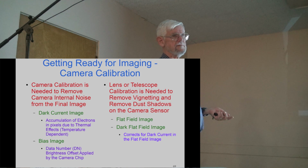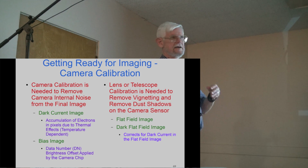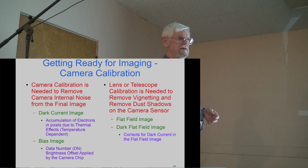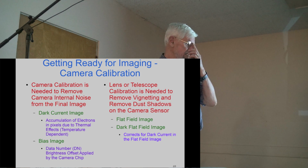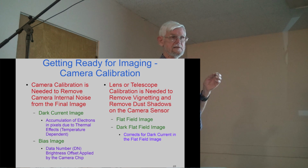It won't be accurate, but there are more errors that are going to come up because of the fact that you have an uncooled sensor than you typically encounter with a cooled camera, a cooled CCD chip that's used for really constrained astrophotography purposes.